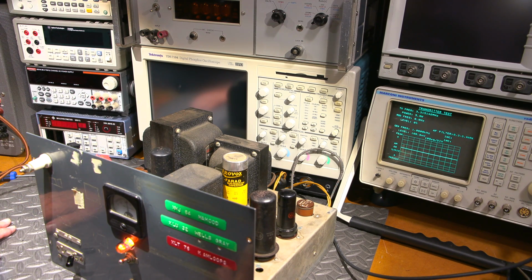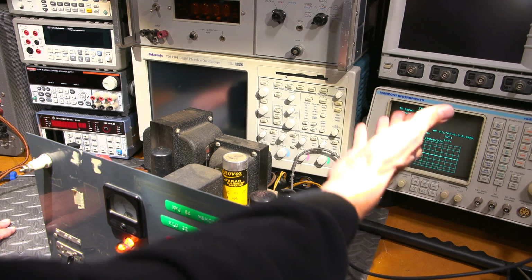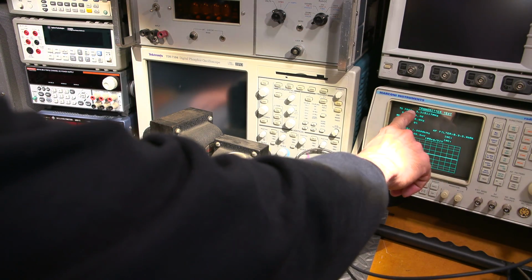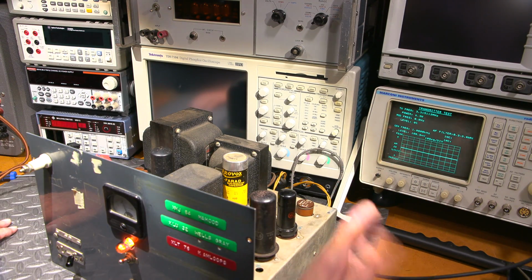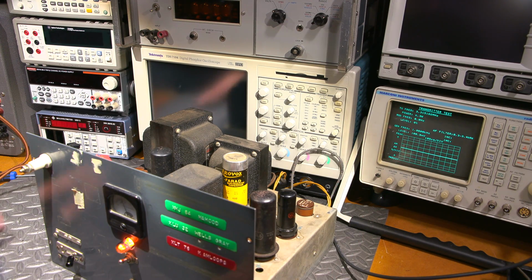Hardly any movement there at all, and you can see it runs in and out of the dip. So now, right in the dip, it's about, I would say, 6.3 watts or something like that. You see right here, and the frequency got quite a bit closer too after I knocked it, so it's at 3.315 now, where it was a little bit higher earlier. So it's very close to where it is, 3.315, 102, whatever.